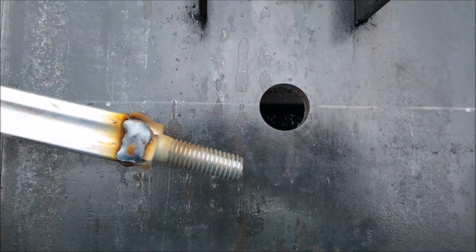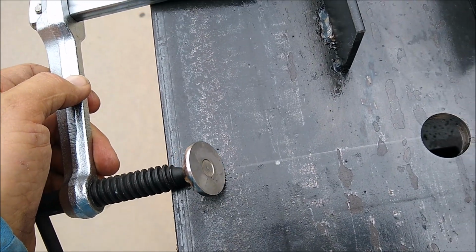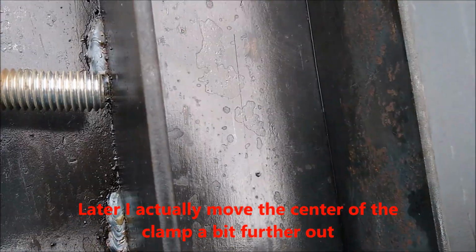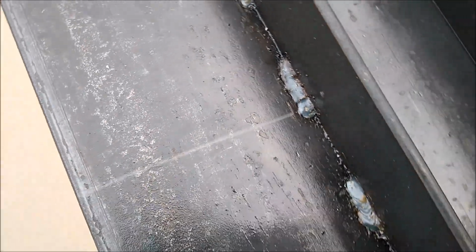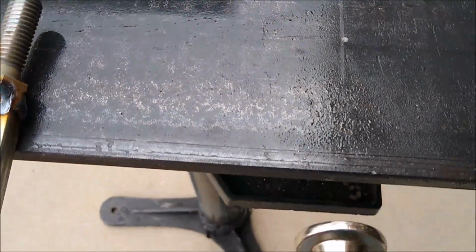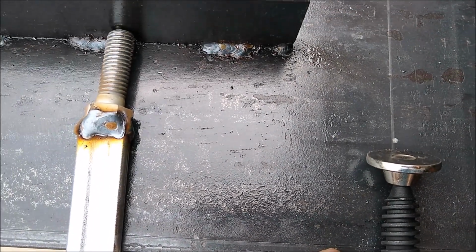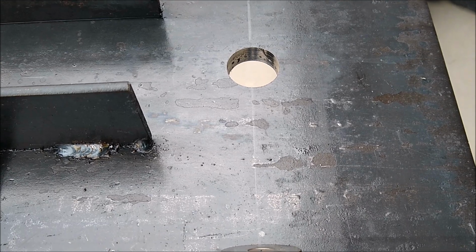that 4 inches. And then I took my piece like this, and I want this clamp to end up right in the middle of that line when I clamp stuff down. So I made a little mark there. Where is it? There it is. And then I just translated that out perpendicular, or straight out from there. Okay, so the bolt hole will be somewhere there-ish, and then this will line up with that line right there. There, that's good. And so that will be right in the middle of that. That should hold whatever piece I put up here, and clamp it.